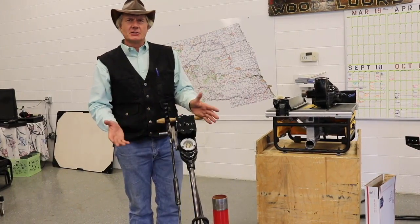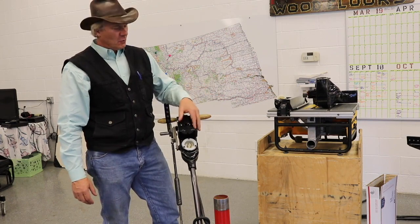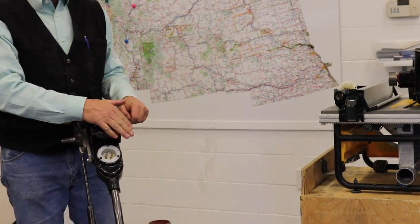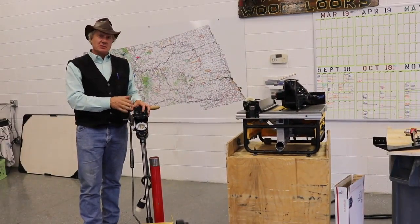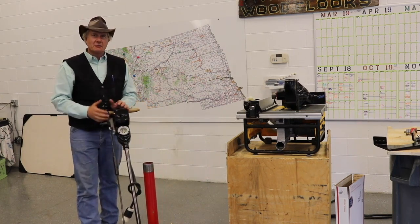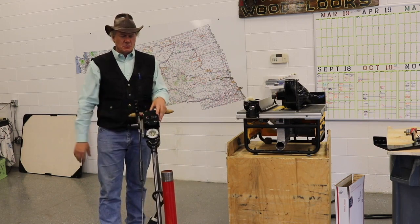When we reworked this power box, we put in a really strong three-phase switch. You can hear that thing — it's got a really nice positive click to it. When you buy these machines brand new today, they have a circuit breaker switch in them, which was never meant to power that machine on and off. I'm told that circuit breaker switch fails on a really regular basis. These good, strong three-phase switches will last years.